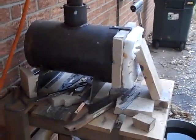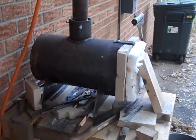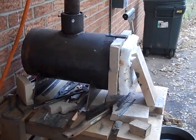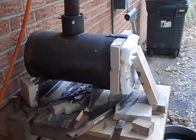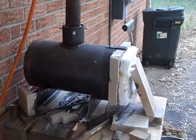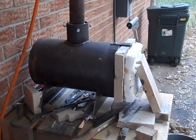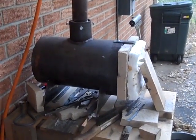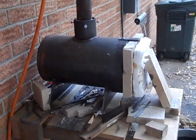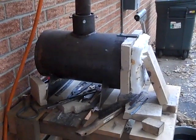What I did was I got these pieces of metal up past non-magnetic, up past, I think they call it the austenite temperature. Basically what that means is I got it very hot. I suppose a good way to explain it is loosened the crystalline structure a little bit. And if we let it cool down very slowly, then when we pull it out, that metal will be annealed. It'll be essentially as soft as you can get it.